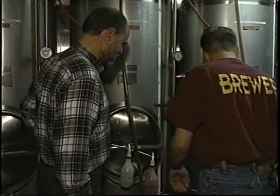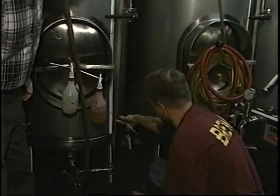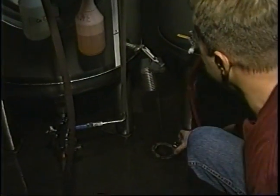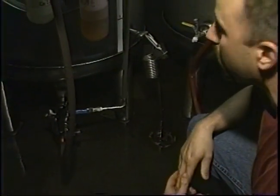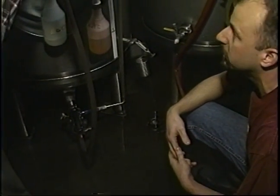And these tanks have a special device here. This is called a proof coil, or a pigtail. And what it does is it lets you take a carbonated sample that's under pressure out of the tank without getting just a big glass of foam.